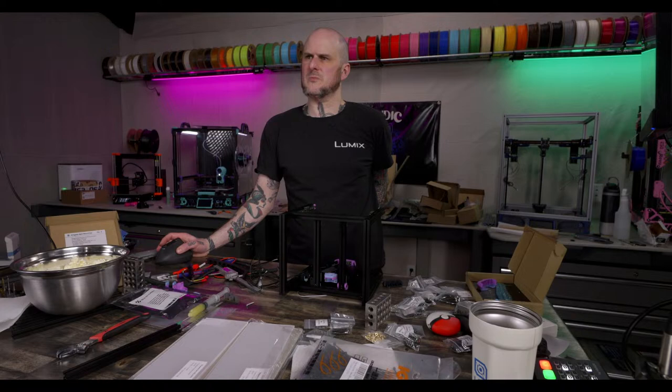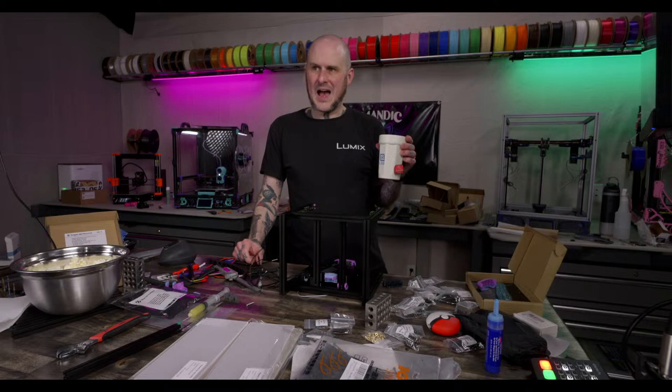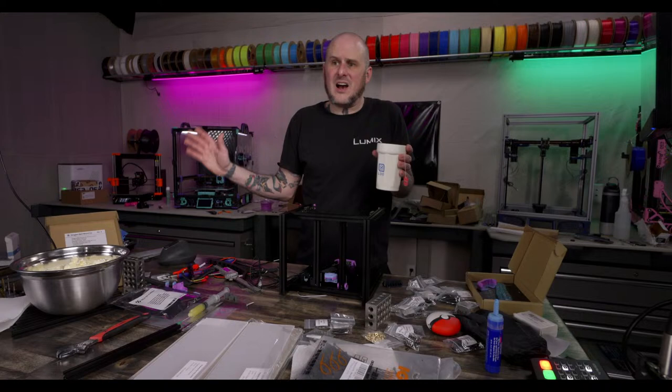Pretty impressed with G2E. It's good. I'm running Galileo 2 on my 2.4. I could take it or leave it, honestly. It hasn't provided me anything particularly. I haven't noticed an improvement in print quality or anything particularly. I actually lost flow rate. When I went to G2E, I lost like 1 mm³/s max. I tested a couple of times, and I lost flow rate. Which is fine. And it's also a little heavier than the Clockwork 2 that I had on there before.